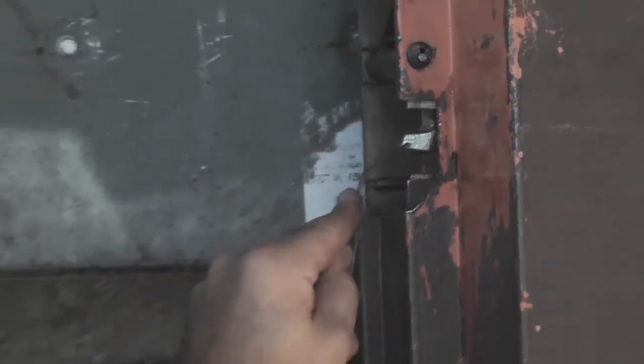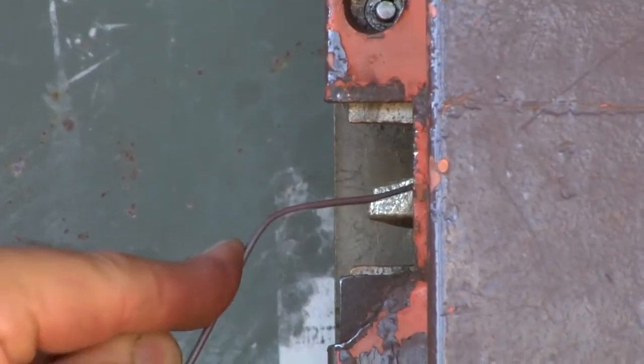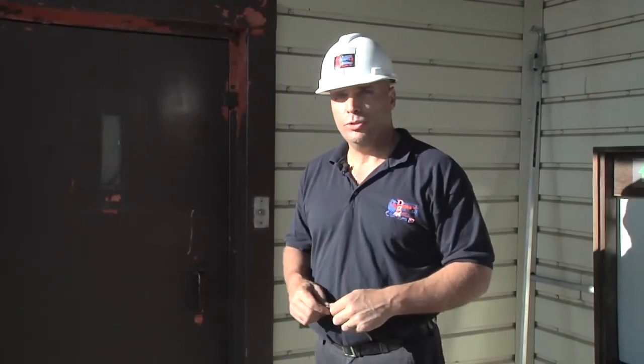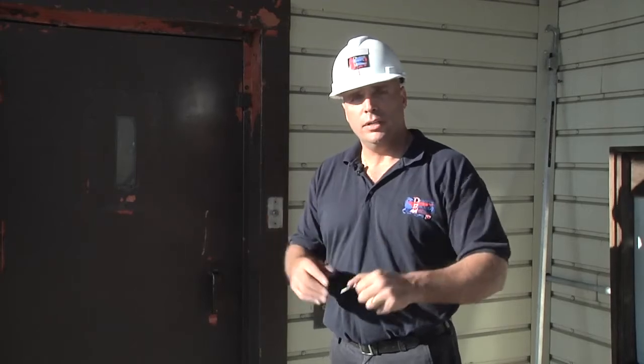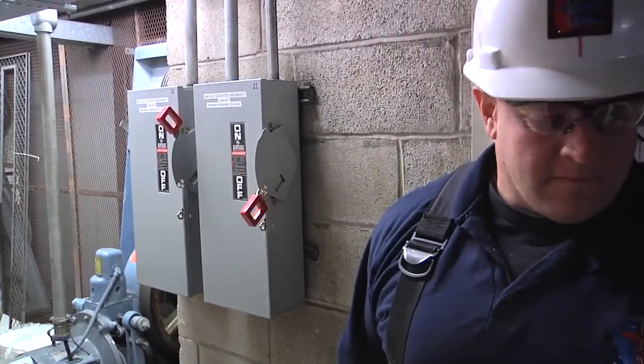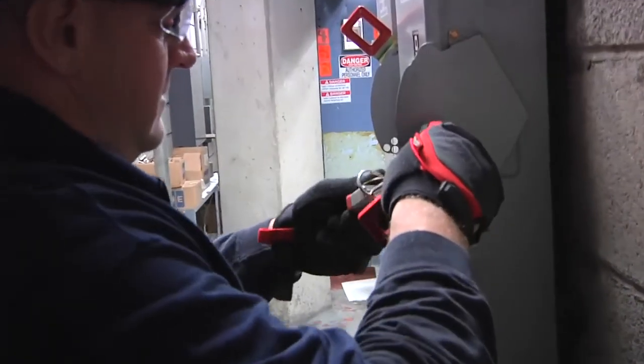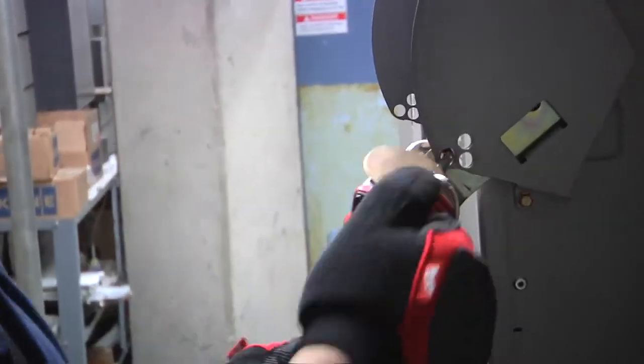So this is our objective: under the plate, through the staple, pushing the latch back. In this segment, we showed you the swing door, key access, and a backup plan of using the GAL pick tool. Definitely you want to have multiple ways of getting through this door. Very important — before we proceed with manual access to a hoistway door — that the power is turned off, locked and tagged out, and confirmed by the motor room team.